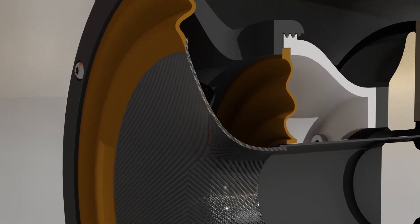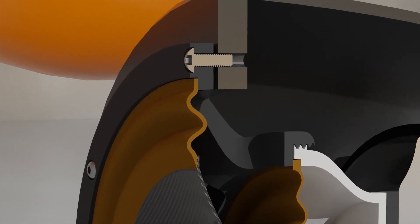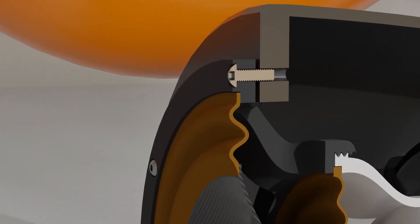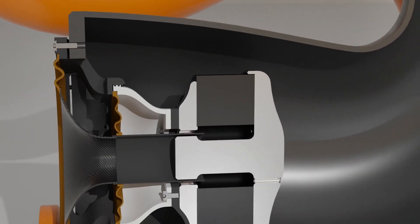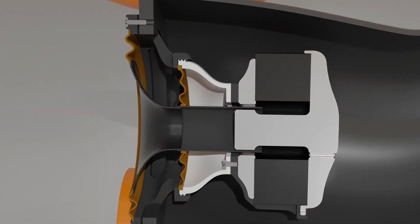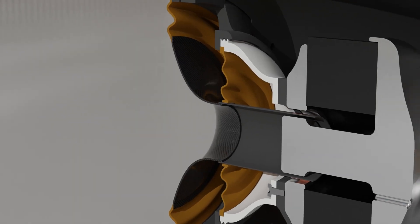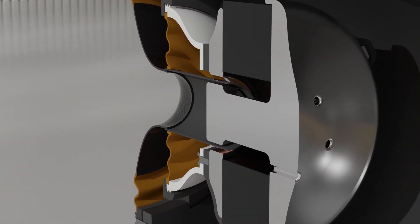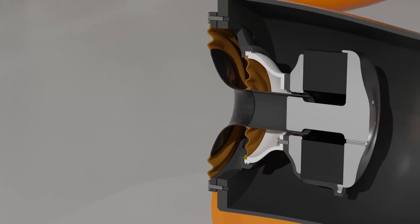The motor is the same underhung design, using a 4.5 ohm coil of 34 gauge wire. The motor plates and magnets are pulled directly from version 17, using the same machined steel plates and ceramic magnets. The motor is vented through the holes on the bottom to provide cooling to the coil, and the whole speaker resides in the same enclosure. By using this enclosure, the data I collect only reflects the changes made to the cone and suspension, as those are the variables for this test.